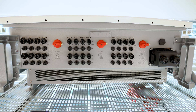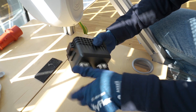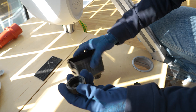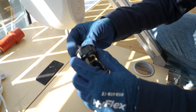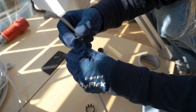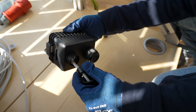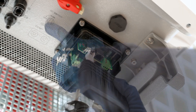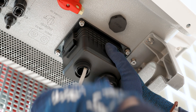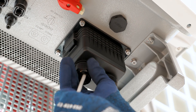To establish communication with the system, first remove the cover from the communications connection area. Then loosen the lock nut on one of the cable glands, slide the lock nut over the network cable, place the sealing plug around the cable, feed the cable through the cover into the inverter, and connect it to the ETH1 or ETH2 network port. Finally, press the cover of the communications connection area onto the inverter and hand-tighten the cable gland.